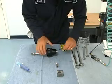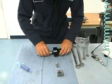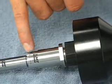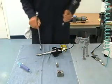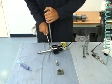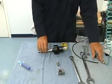Now we're going to apply air to it and finish turning this the rest of the way in by hand. What that does is raise the piston up in the actuator and take the pressure off the poppet so it's not grinding itself into the poppet landing as we tighten that down. Then we need a one-and-an-eighth and an inch-and-a-sixteenth, and we just torque this to thirty-five foot-pounds. Then take our air off.